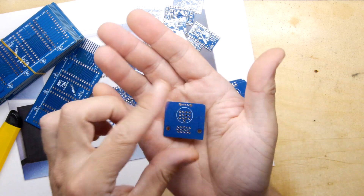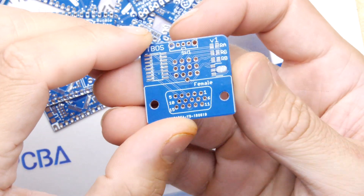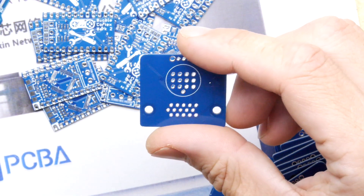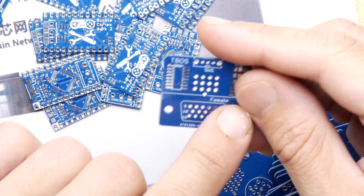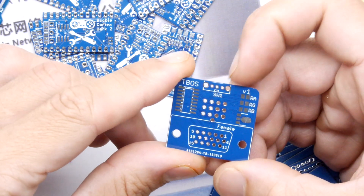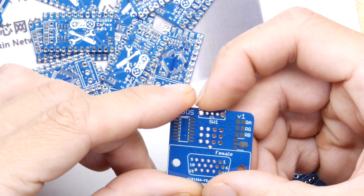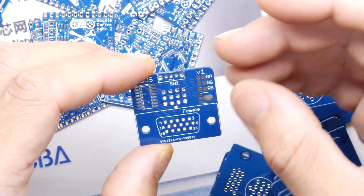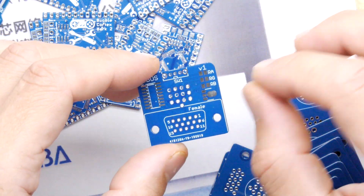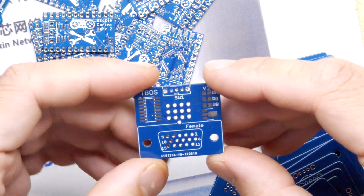The final project is another Atari ST board, which I think is really cute — it's an Atari ST to VGA adapter. There's a connector that goes into the Atari ST's DIN-type video port, a VGA connector you solder on, and just a little switch. One switch position is for low and medium resolution, and the other is for high resolution. It's basically a digital switch routing the correct wires, because high resolution is monochrome and it's not trivial to handle with a simple mechanical switch.